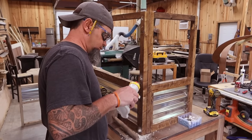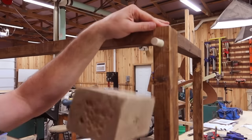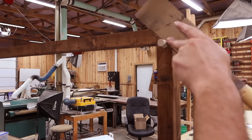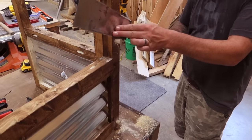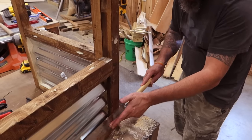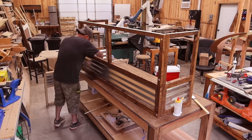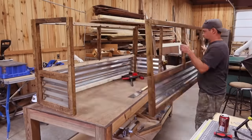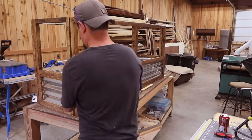I'm just using that half inch spade bit just to create my countersink and it will also fit my peg. And as you can tell, my hammers have not shown back up, so that's why I'm still using this one that Noah used on the arc. Then I'll just give this peg a little trim and we'll continue this for the other three sides. Do not think that you have to install pegs — you do not. It's actually kind of overkill, but it will make for a little more of a clean look.